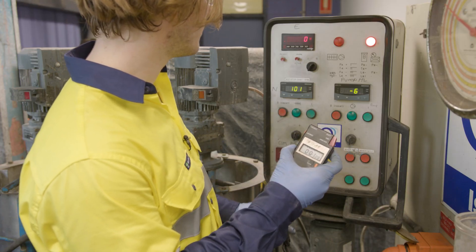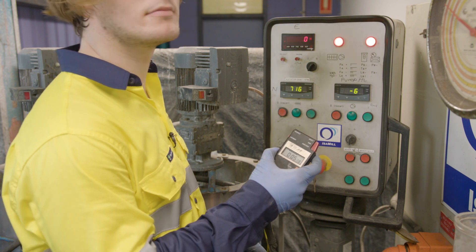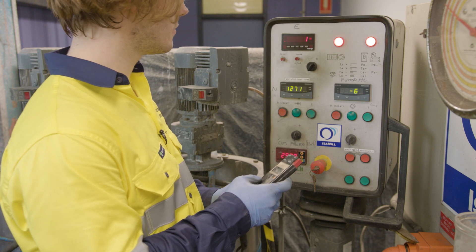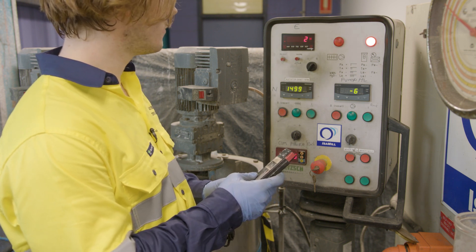Activate the M4 shaft and adjust the speed to 1500 RPM. Run the mill empty with no media or feed for at least 20 minutes. This is to allow the mill bearings and seal to warm up.